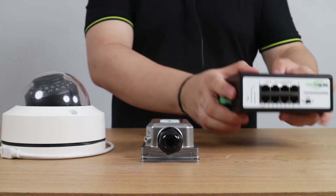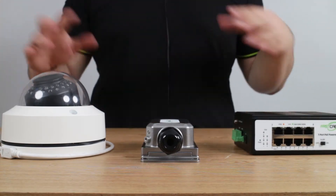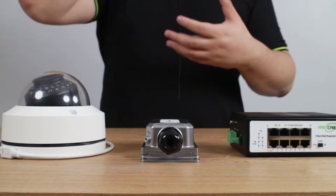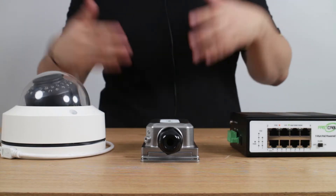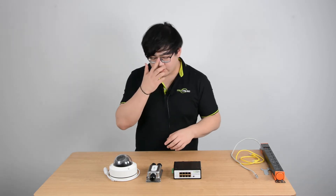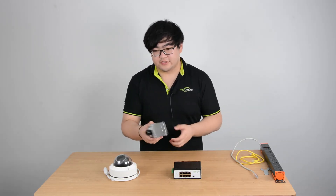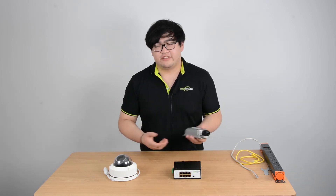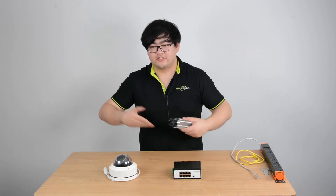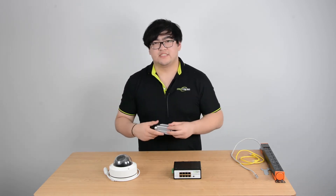It's kind of like an outdoor PoE switch and it's pretty mobile, so you can expand your territory however you want without wondering: if I want to set up a camera here, is it going to be too far away? Will the reception be bad? You don't have to worry about a lot of these. This switch is good for multiple cameras, but this other one you can also daisy chain it — connect one extender to another with two ports and chain them. It can go up to 500 meters in some circumstances, which is pretty useful.